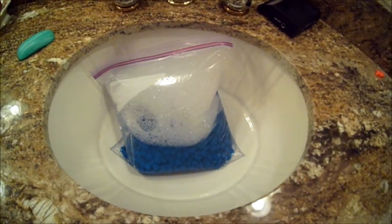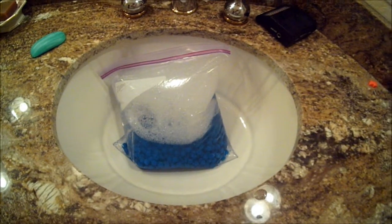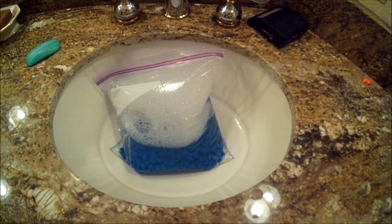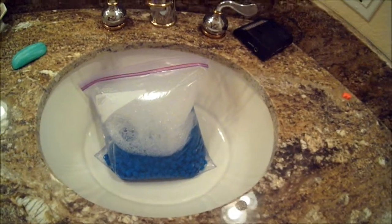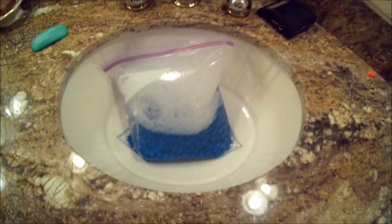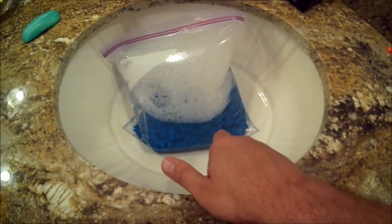We waxed the molds that were gel coat. The molds were made out of, I would say, four to six layers of cloth and a three-ounce mat. It was about a half-inch laminate — they were real thick. But there was also special tooling resin that was flexible and you could bend them out. Anywho, these dart heads are the same thing — they're molded products.